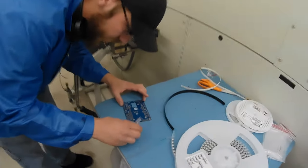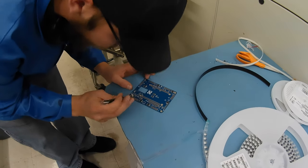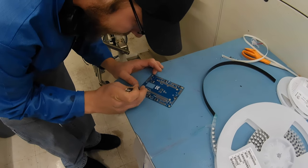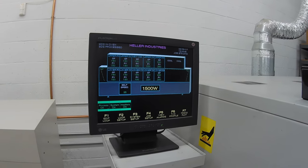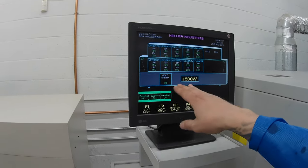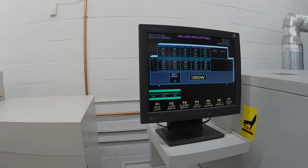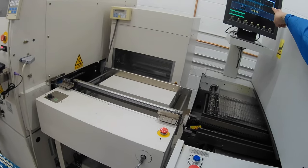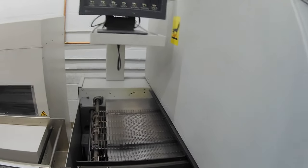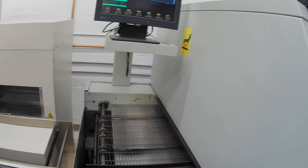Oh, I was wondering about that. So, yeah, C4. Then we're halfway paid. And the switches. Correct. After we wash, yeah. Maxing out at 260, and since it's lead-free solder paste, we actually kick the belt speed down to 35. Usually it's about 70. So we get a little more time in each zone. Correct. The last two zones are the cool. And that's just supposed to be room temperature? Yeah, whatever. Bringing it back down. So they're still a little high as they come out, but within that cooling period. Wow. Okay. All right. I get it.